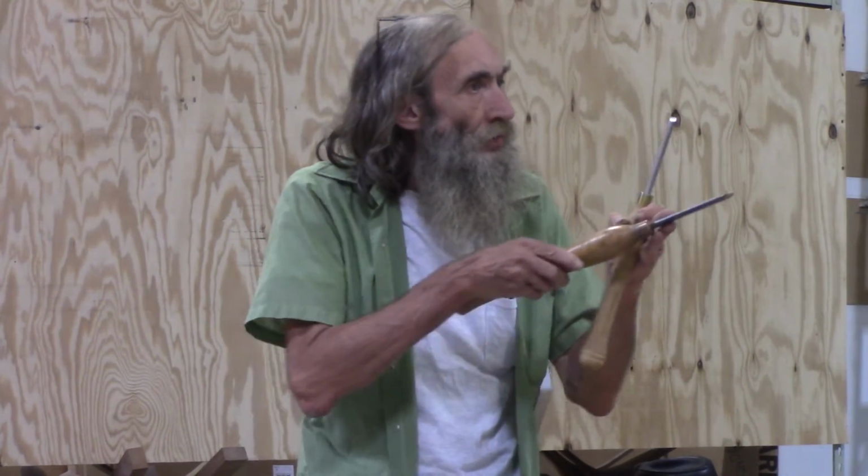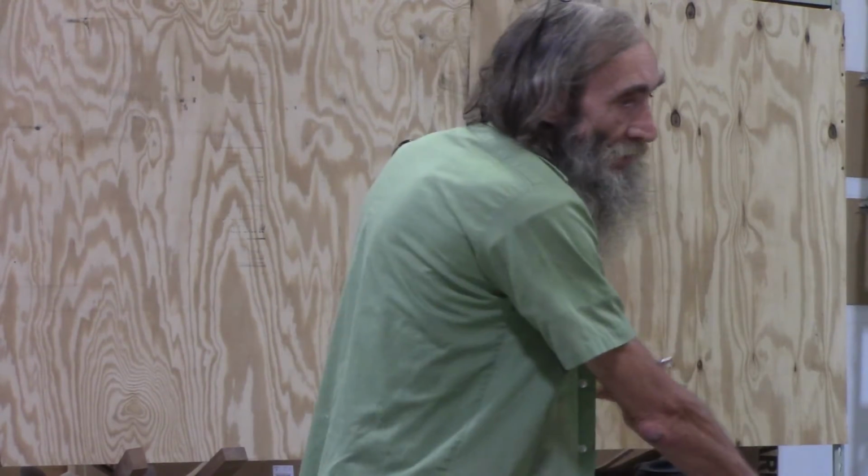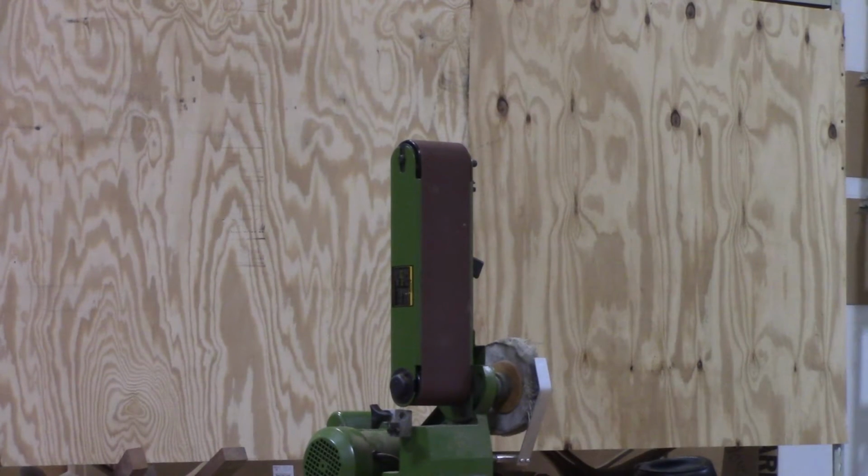Basically, what Warren does with it is when he's cutting the inside lip on his boxes or a piece that needs a square recess, he'll set it so that the point is going in dead center, and he can just go straight in. There's no bevel, and he doesn't have to adjust. He can actually use this edge of it as a follower as he's going in and get a nice straight cut, because everything rolls around it. So that's where, you guys want to pass these two around. They are sharp. Anybody who comes up with blood, it's on their own head, not mine.